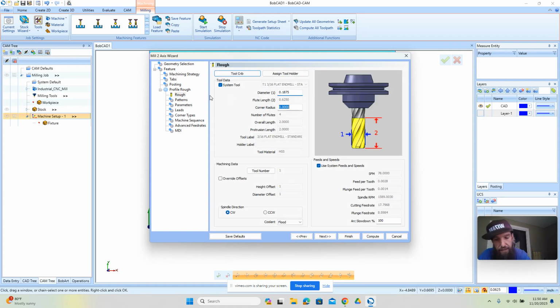On 875. And then over here, our speeds and feeds: on these particular industrial CNC routers, you control the spindle out at the machine, so we don't have to type that value there. And as far as cutting goes, I just cut everything at 50 inches a minute. This is a good starting point for most materials, especially something you would run on this equipment. And it also takes the guesswork out of how fast to run or not.